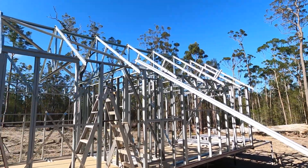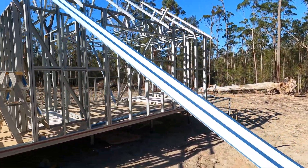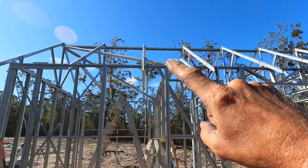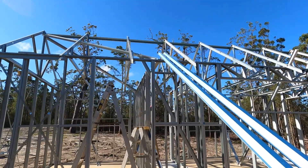That's what our little cabin looks like with the roof trusses on. Now I've just got to batten it out. Roof battens — they can be timber or steel — and then the roof iron obviously gets fixed to that. You do not fix your roof iron straight to the trusses; you've got to have battens running 90 degrees to the trusses.